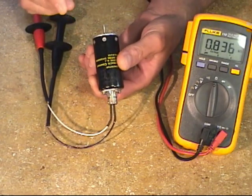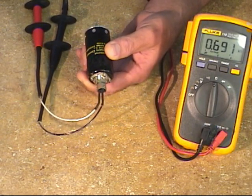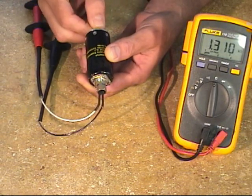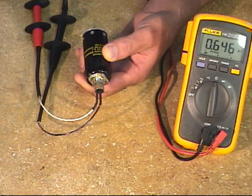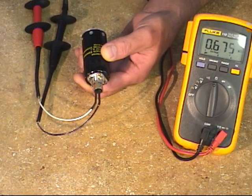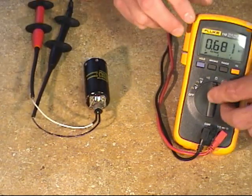Another thing you might do is tap on that shaft a little bit. This one's a little bit high resistance. We'd go a tenth of a turn at a time and log in the readings. Don't worry about the numbers while you're turning the shaft — of course the meter will just be erratic. Looks like I saw a 711; that might be my lowest. There's a 650, so we're all the way from 650 to the mid-800s. There's an 850, so this is a pretty rough one. I've seen everything from 650 to 850. We can go around on all six transducers, carefully logging the highest and lowest resistances observed at every clock position.